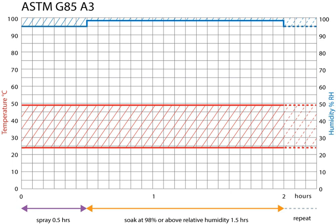Although the majority of salt spray tests are continuous — i.e., the samples under test are exposed to the continuous generation of salt fog for the entire duration of the test — a few do not require such exposure. Such tests are commonly referred to as modified salt spray tests. ASTM G85 is an example of a test standard which contains several modified salt spray tests which are variations to the basic salt spray test.